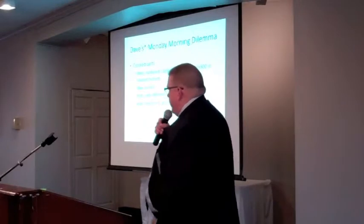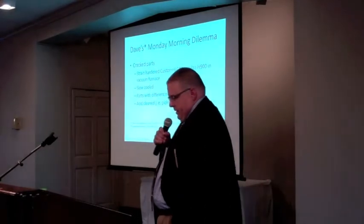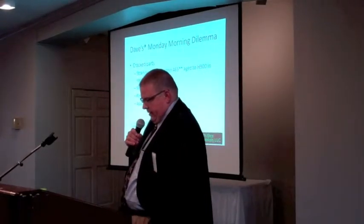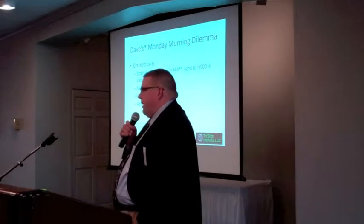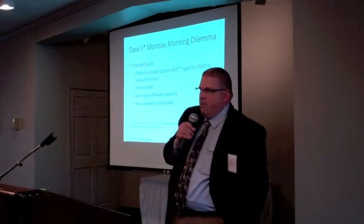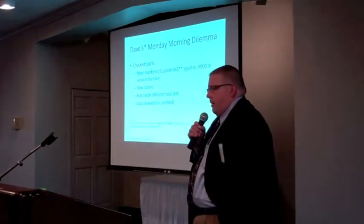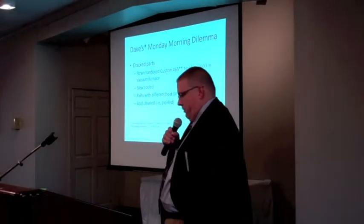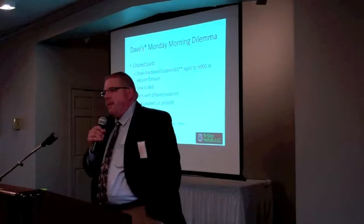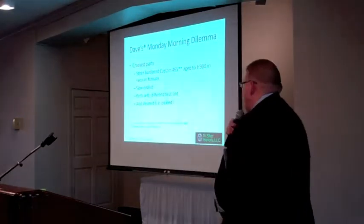I asked Dave what condition he was using the Custom 465 in. He said, 'I've heat treated it to H900.' I asked how he heat treated it to H900. He said, 'We have a vacuum furnace and I ran it in the vacuum furnace.' I asked if his vacuum furnace had a backfill quench or purge — no. What he did was put the parts in at the end of the day, set the furnace to turn off after he left, and took them out the next morning. So the parts sat and slow cooled in the furnace. And he noted something odd — the parts came out heat tinted. They were used to dealing more with 17-4.